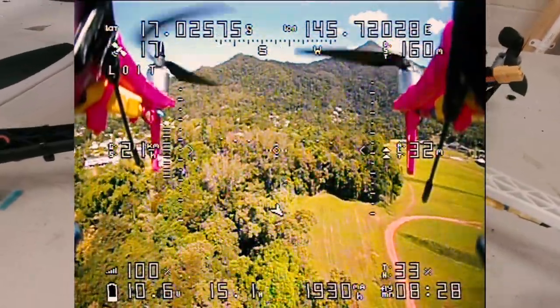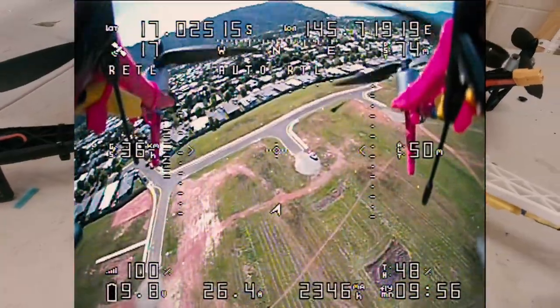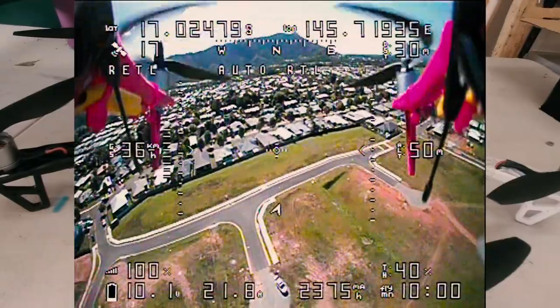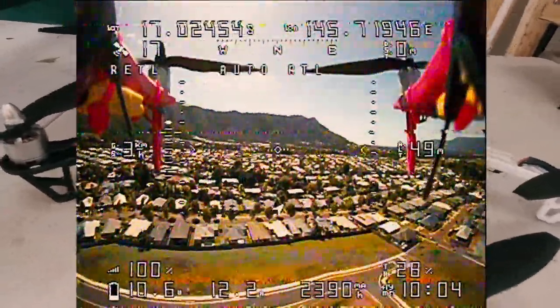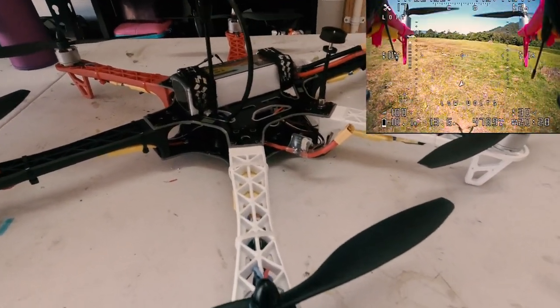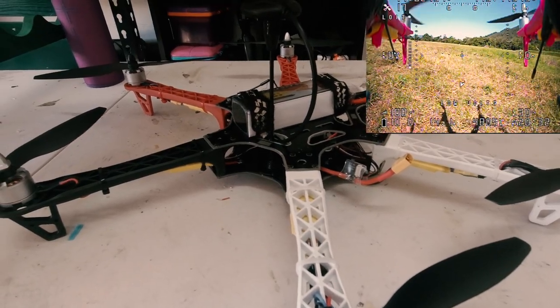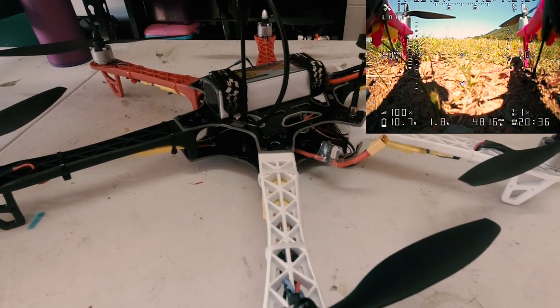The tune has made a difference. I got rid of the loiter issue I had which was making it wobble with a bit of wind and stick movement. I found the P gain was just too high, so I lowered that down and it's resulted in quite a nice craft, comparable to my Phantom which also runs around 20 minutes. I've just brought it back and I might do a test on the battery to see what levels we still have after nearly 21 minutes.